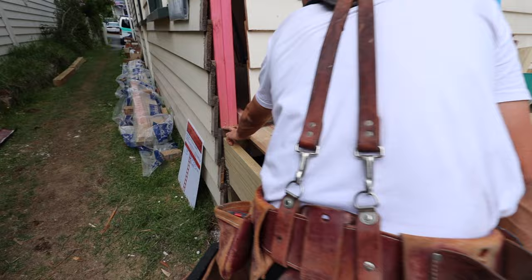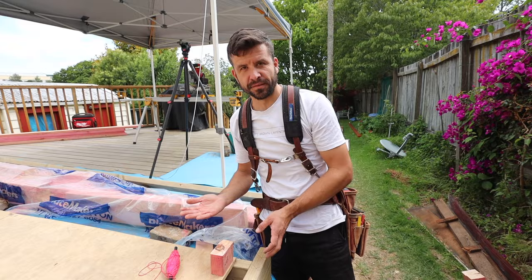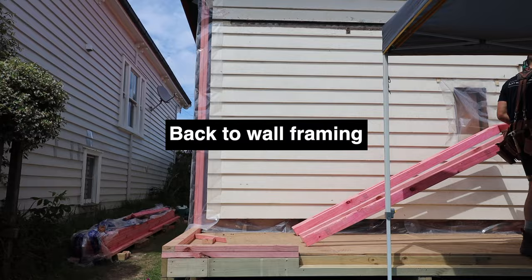So that's 100 mil, 103. The bottom plate here is 103 - same as the bottom plate. Our 90mil wall is going to have to be packed. The old style framing in New Zealand is like 100mil, but what we use now is 90. So we always put the 90mil and then we pack the inside - it's much easier to pack the inside after the building's been closed in than it is to pack the outside.